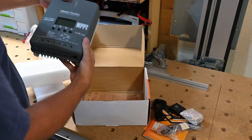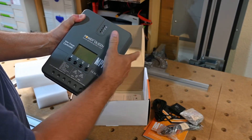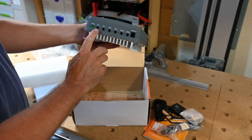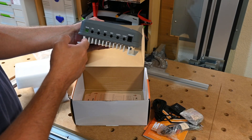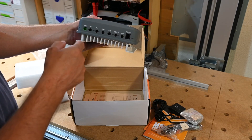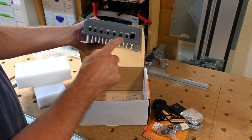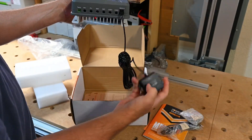Let's see what the controller itself looks like. That's actually really nice. It's got that soft-feel metal — not glossy, kind of matte, but it does feel good. One thing I like to see is that on some charge controllers the inputs for your wiring are so small it's hard to get a ferrule in there. I like to put ferrules on the end of my wires to keep it nice and solid, and you've got a very large opening to put some pretty heavy gauge wire down there. That's where your temp sensor and Bluetooth dongle plug in.